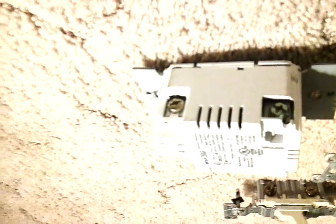Okay, I'll turn this around so you can see — I'll zoom right in close on it. Can you read the writing on the back of that? You put the ground wire in on the hole in the back after you strip it, where the green one is. Then you put the line and the load on these two screws here, and they're marked line and load next to the hole where you insert the wire. The one on the left is the line — you can see, there's 'line' right there. Then the one on the right is the load — there's where it says 'load' — and it goes on that terminal.